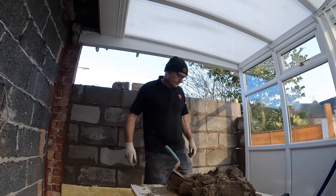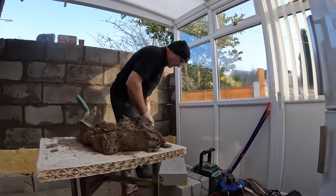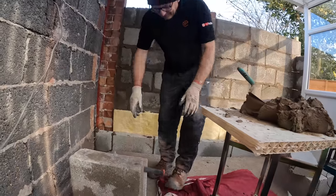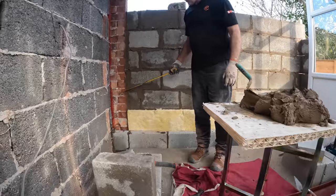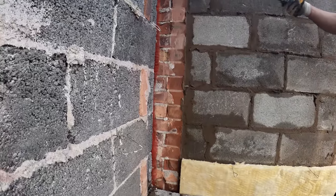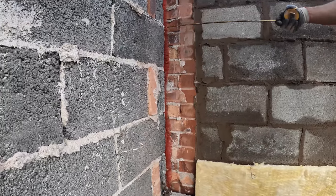Snappy. I need some blocks. Oh, well, you heard it from the boss. You need some more blocks soon, but as you can see, Dad's on the inside now. So while he's getting that set up, I'm loading him up and tidying up some of this mess. You can see we've cut the wall off now. Yeah. That's where the wall was turned. So now it's a continuous wall all the way through. We'll take this thing out and we'll continue the insulation through, so it's a continuous cavity.